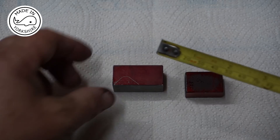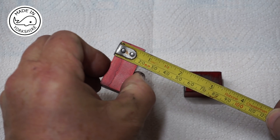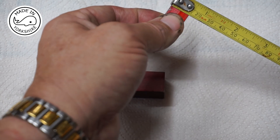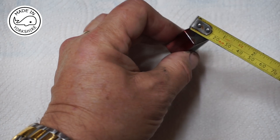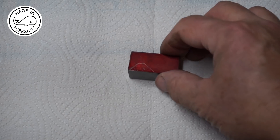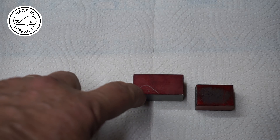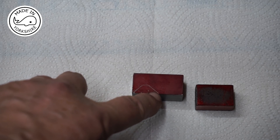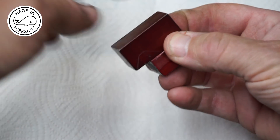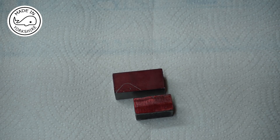So I've cut some pieces of mild steel. This is a piece that's roughly 40mm by 20 by 20, and this is a piece that's around 30 by 15 by 20. On this one I've just scribed the shape of the bed — the bedway I think you call it — on the lathe. So the idea is that will fit on top, this will fit underneath, and there will be a bolt that goes through there to lock it.